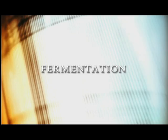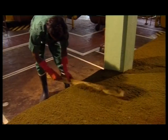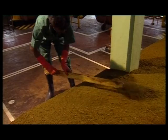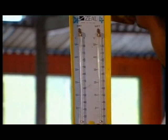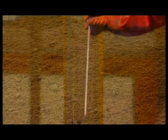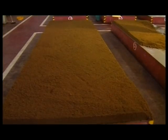After sifting the tea, the next important process is oxidization or fermentation. Withered leaves are placed on marble or ceramic slabs about 1 inch deep in a fermentation room maintained at high humidity levels at the lowest feasible temperature, around 25 degrees to 30 degrees Celsius. Lower temperatures help to improve flavor characteristics. Then the tea is spread on the slabs.